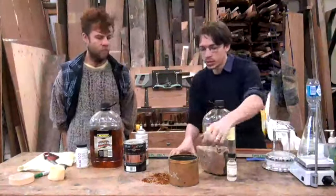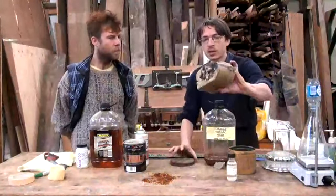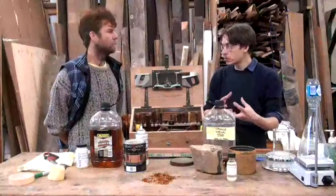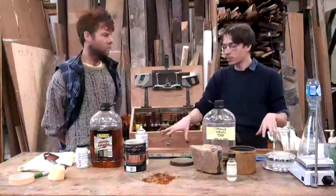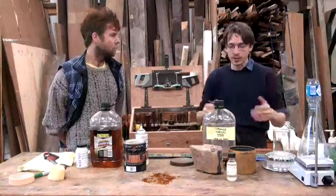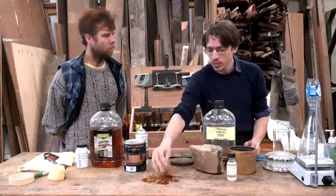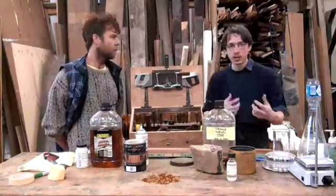And that's a really simple one. Shellac is great. It lives in that family. Wax also lives in that family. So a lot of soft waxes have had turpentine or something added to them as a solvent to soften them enough to be able to apply to the surface. And then that'll evaporate out, and you're left with it. That's the most simple. Also, in restoration, we love shellac because you can rework it later with alcohol, and you can keep messing with it.